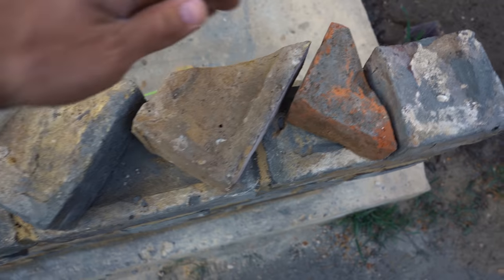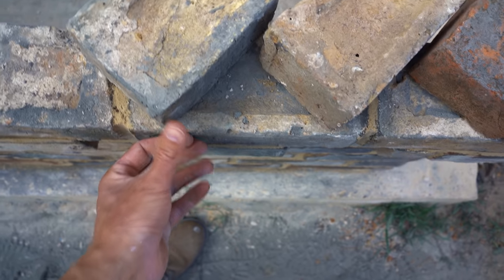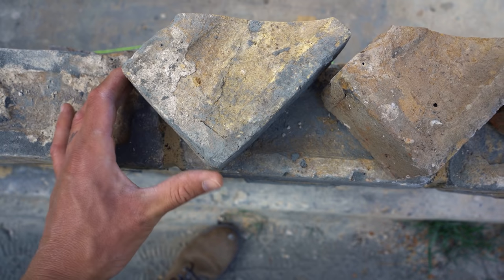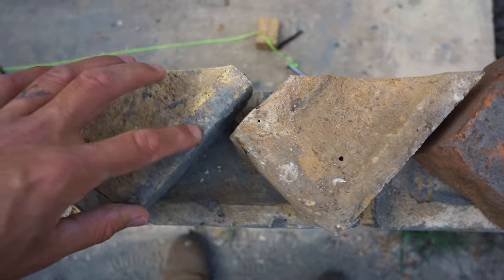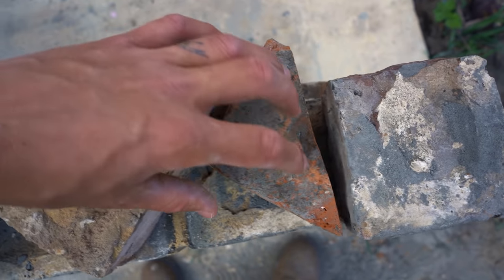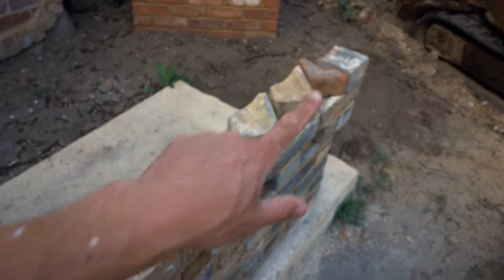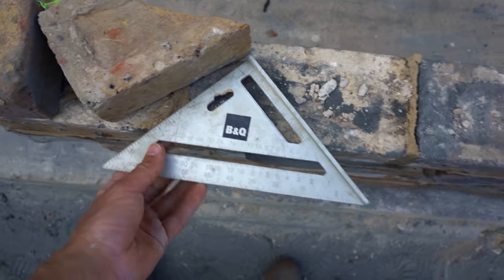As we look down from the top you can see on the back these are cut flush with the back of the brickwork, and on the front you get what I like to call the pointy bit — nice and technical — they're the corner arris of the brick, in line with the brick below. What you also want to do is keep that 10mm gap for your perps. To get this cut I always work backwards from the end that doesn't have the cut, put a full one in the end, dry lay it and work it out so it comes to the end — and that is the cut.